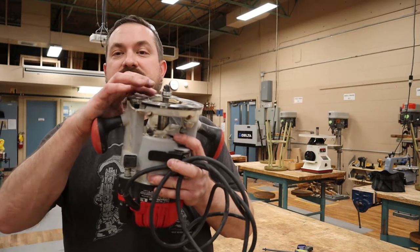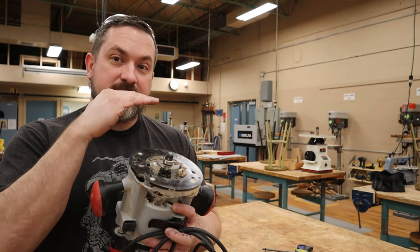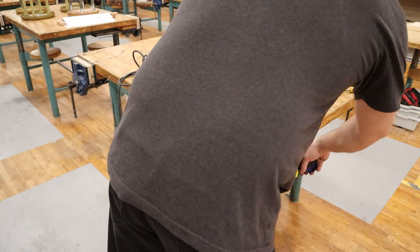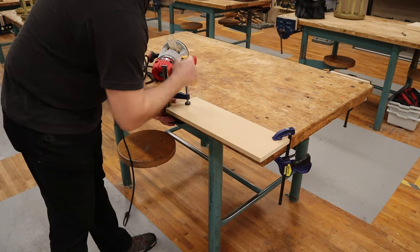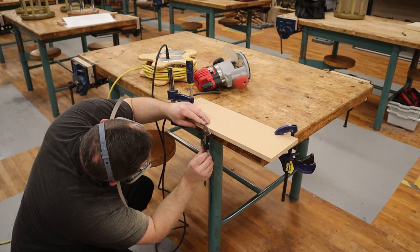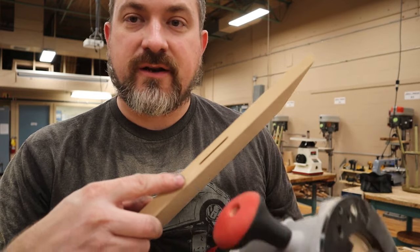So next up is putting the little slotting cutter in our router, and we have a test piece that we're going to get set up here so that it is exactly in the center of our 5/8 thick panel. That way if we screw it up or if we have to make some slight adjustments, we can just throw that piece in the garbage, and our arcade left and right cabinet sides will be perfect. So that's what we're going to do right now. So with this right centered now in my scrap piece, I'm ready to go, this is set.